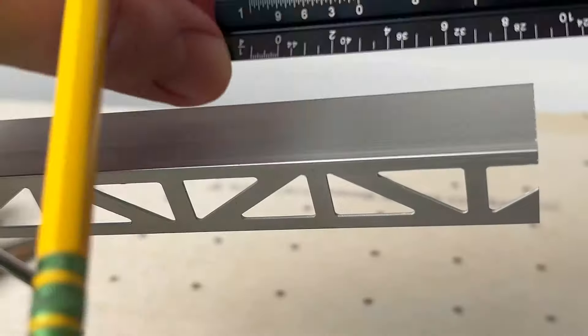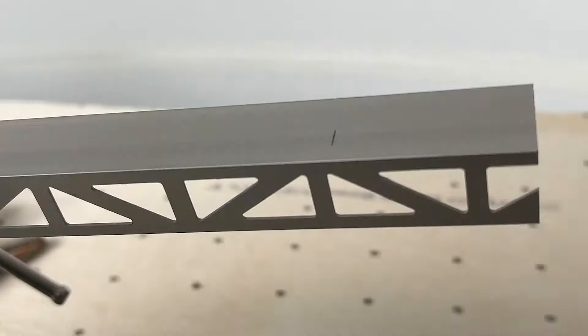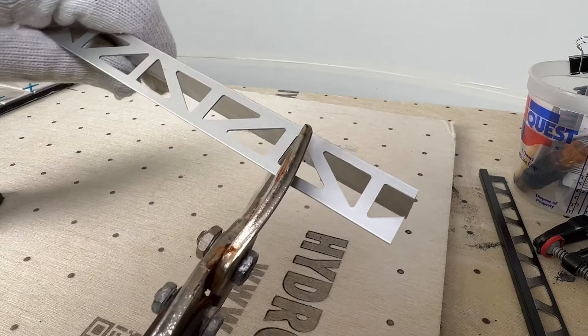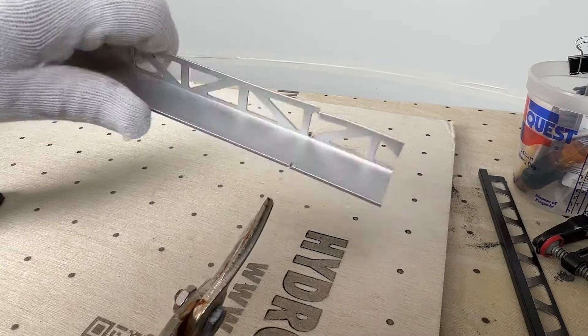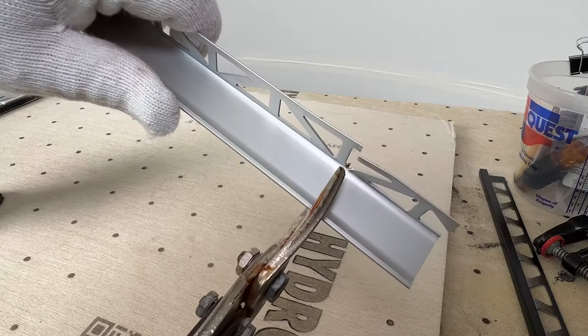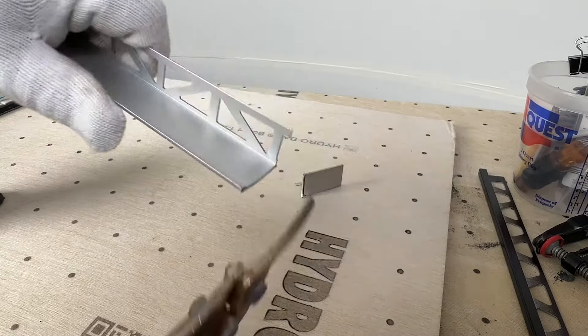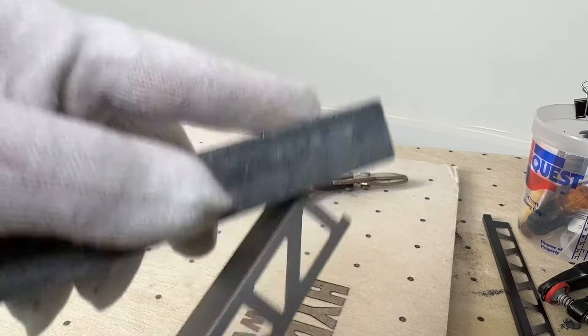Don't be nervous about cutting your metal edge — I'll give you three ways to do it. The first is using metal shears. Once you mark your metal at the length you need, take your shears and cut along that line. As always when working with metal, make sure you've got your hands protected with gloves, and after the cut, use a sanding block to ease down those edges — they can be sharp.